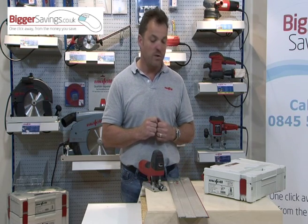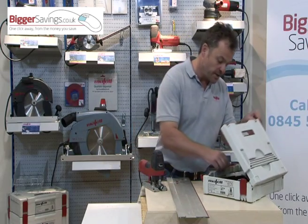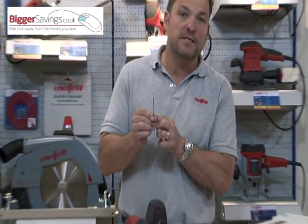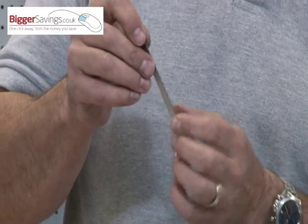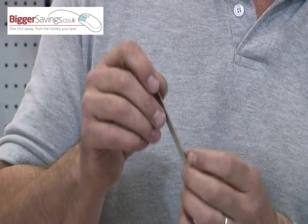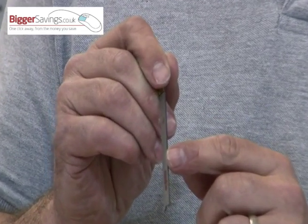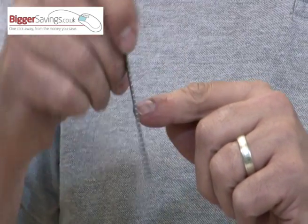They started in the same way as every other manufacturer by beefing up the blade guides. You've got a thin piece of steel with two tight bearings or guides; the jigsaw is going up and down 5,000 strokes a minute, the blade is going to get hot. When the blade gets hot, it gets soft and it will give. Also, if the back of the blade hasn't been precision ground to 90 degrees, when it hits your rear roller, it's either going to flip left or right.